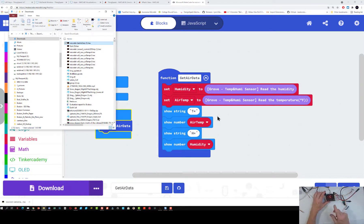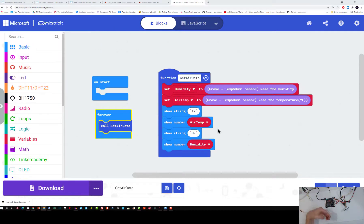We've got to let it run through. Right now it says my temperature is 80.41 in the room, and the humidity equals 50.01. That's really all we need to be able to get temperature and humidity data streaming across my microbit. What we're going to do shortly is we're going to add a screen that we'll also attach to our I2C hub. That will allow us to continually see it, otherwise I have to hope I catch my data scrolling across the microbit screen at the right time — which, as we add more and more sensors, is going to become a little cumbersome.